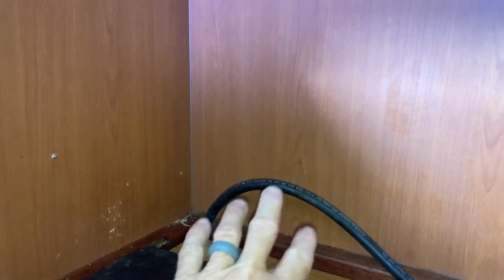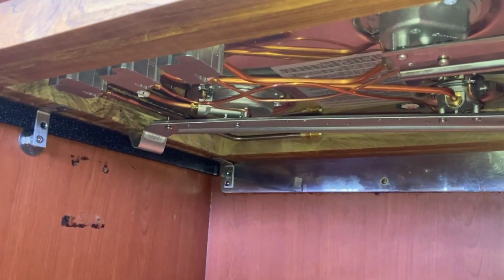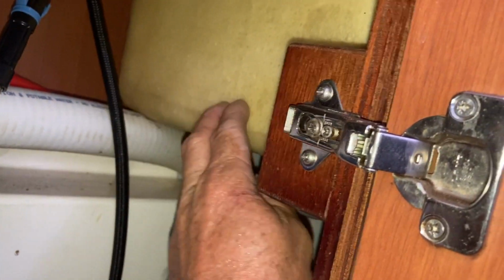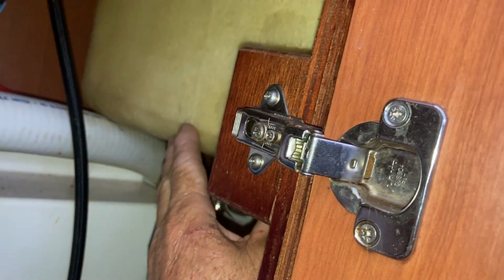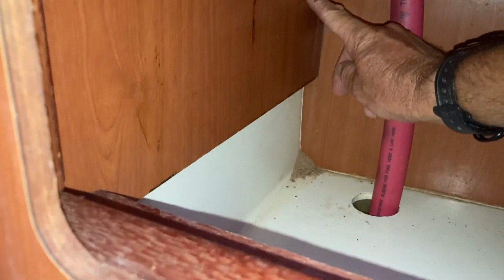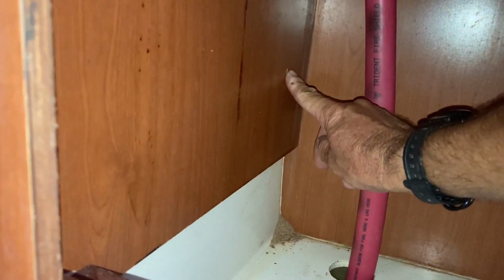And now what we're trying to do is basically get a 110 outlet back here under the stove area. So basically, with a bunch of extrapolating and measuring using kind of this, this is the dish drying pan for reference. Measuring down about 15 inches. Drilled a small pilot hole right there. That's going to be our 110 in.